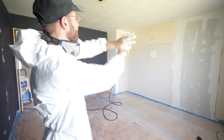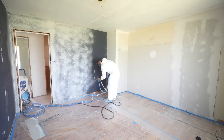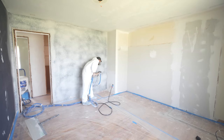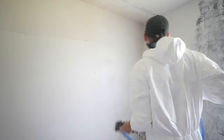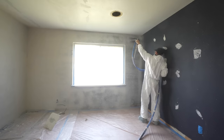This is the master bedroom — it's got a whole area where we opened up space for the new master closet. I'm excited to see how we can blend this new work with the old construction. On this wall, I got back to doing little cursive circles while going up and down and got a noticeably better result. Doing those little O's is better than just going back and forth because you don't have a stop-and-start point where texture could build up and ripple. If you've got drywall texture spraying experience — DIY or professional — I'd appreciate any helpful comments down below. I want to create a helpful resource for people in a similar situation.